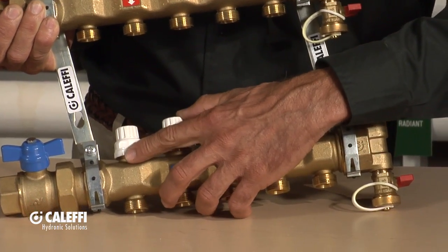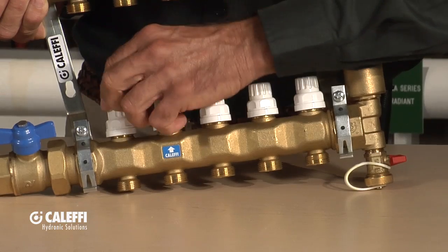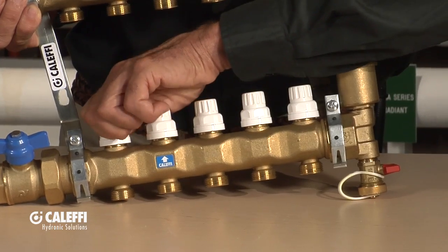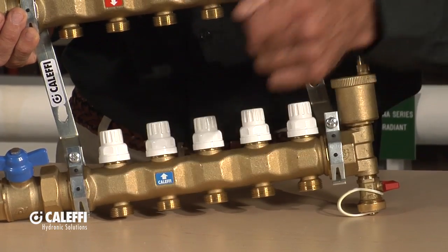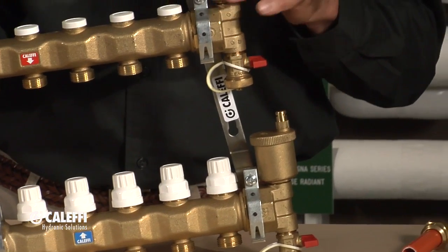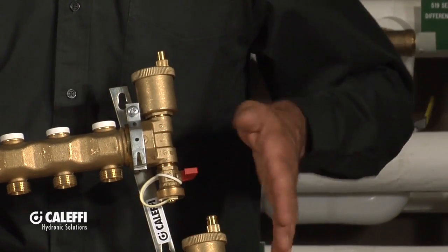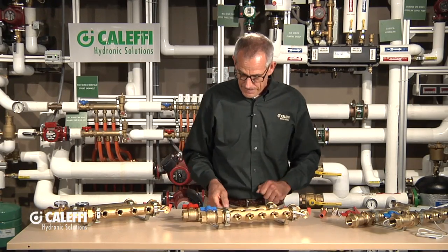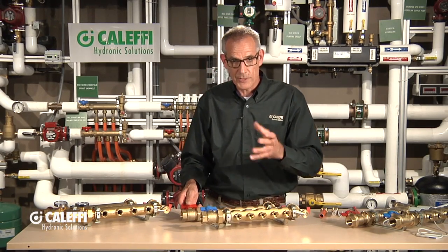On the bottom of this manifold, on the return side, you can put zone valves on it. There's a little plastic cap you can turn on and off like a thumb screw to isolate it. You can isolate the top with the Allen screw and the bottom by turning this cap. But if you wanted to, you could take that cap off and put an actuator on there — now you can start zoning this manifold so every loop has its own zone control. We've also got the same float-type air vents and purge valves on the end. This manifold is available with inch or inch-and-a-quarter connections and isolation valves sized to match your order.